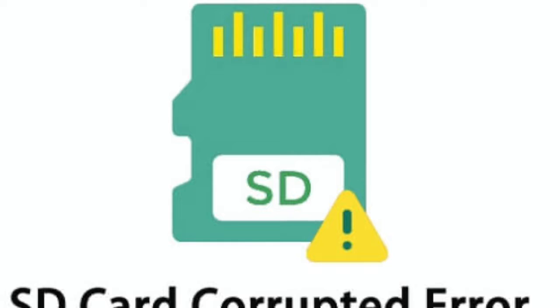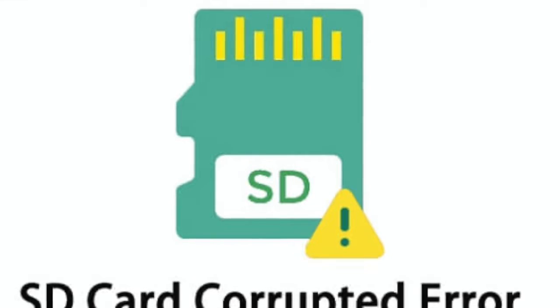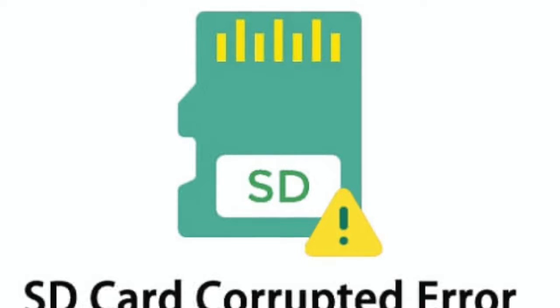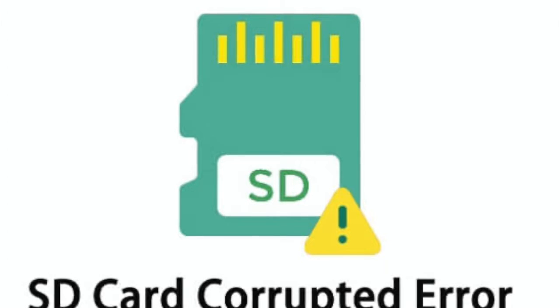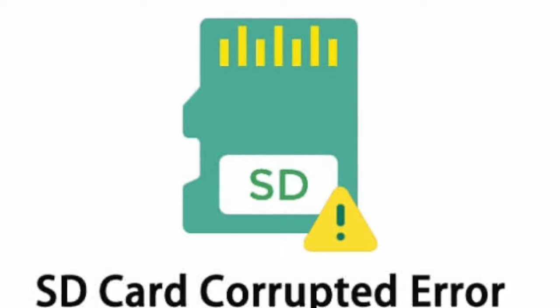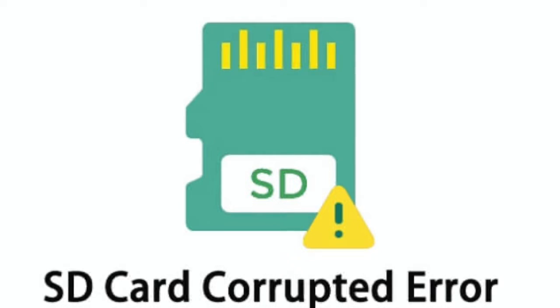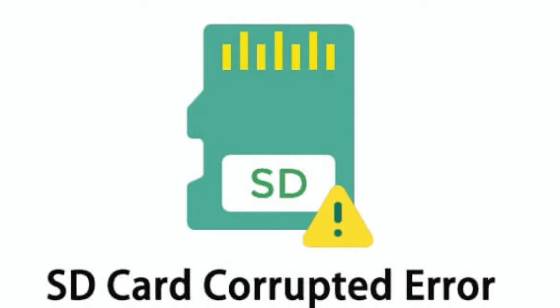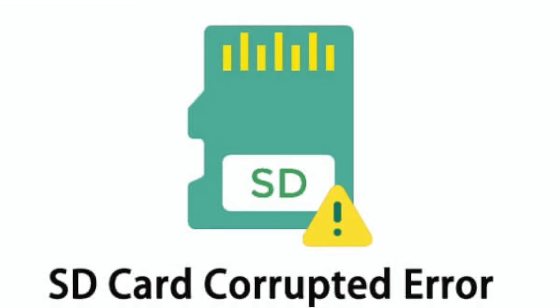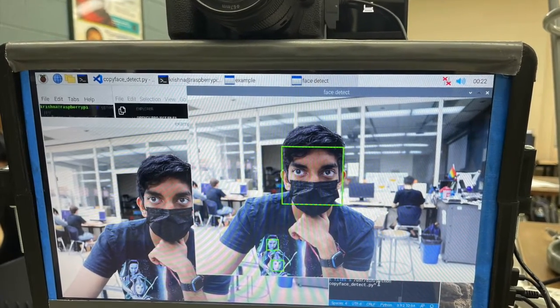And the biggest mistake I made was removing the SD card or losing power while a program was being operated. The Raspberry Pi does not really have any security measures in place to protect your data or all your code. So if the SD card gets removed while the system is running, or if the power goes out, then the system can get corrupted and your files can get lost. And this happened to me twice. I wrote about this in my blog. For more details, you can look there. But I was so annoyed. I spent hours repairing all the damage I caused. Luckily, in my blog, I wrote down how to go back over my steps and trace back what I needed to do, so it wasn't like starting over.